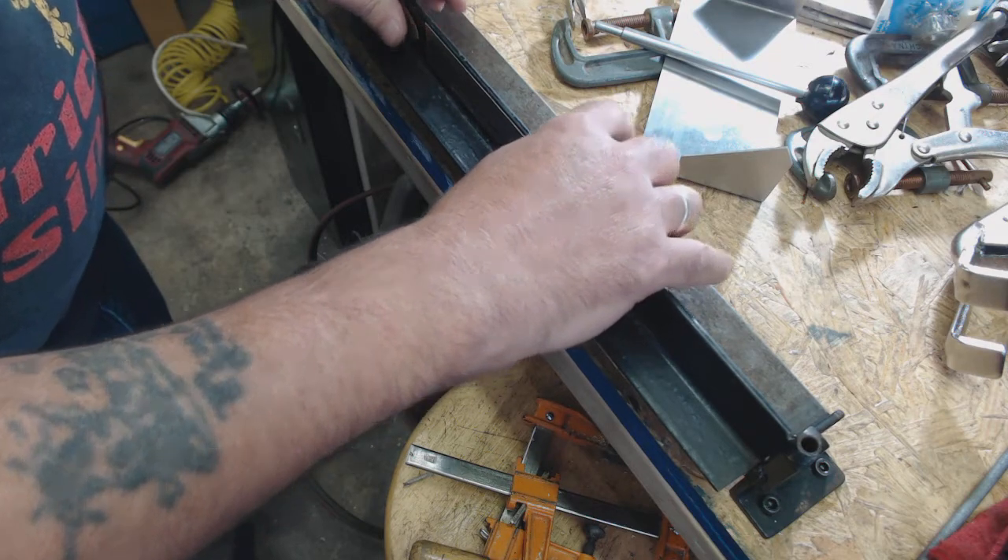If you're doing a 90-degree bend, right there — you can see where the machine does the bend. But of course you have to account for the material thickness also. So I think I got the bend bar in the right place. I can't have the bend bar right up against where it folds because there's no room for the actual material itself in between.